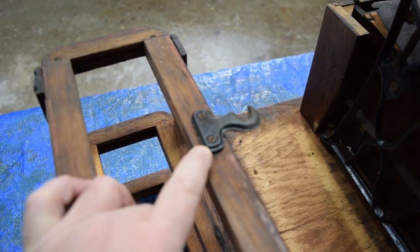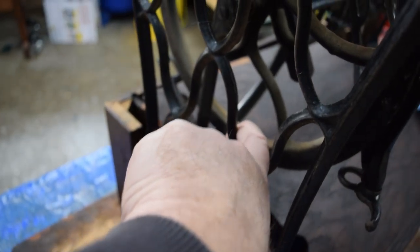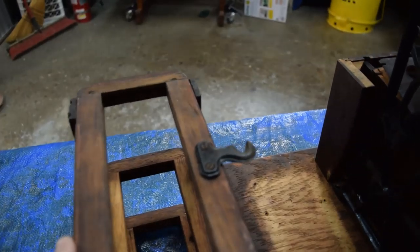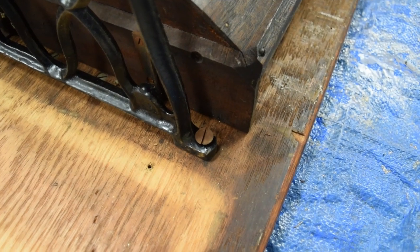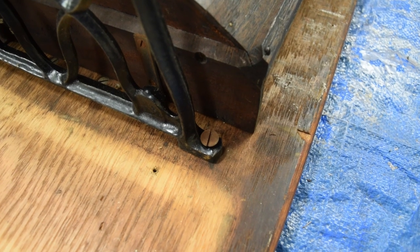And in addition to the four screws, we have this little hook. It hooks into this part of the cast iron frame and it keeps the drawer from doing this. So this just comes out with two screws. And with the drawer assemblies removed, the next step, obviously, is to remove the cast iron base assembly.